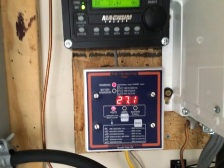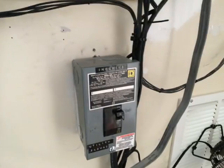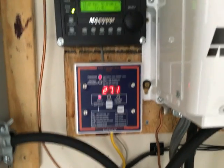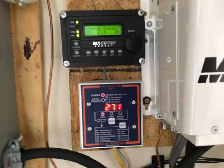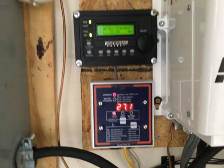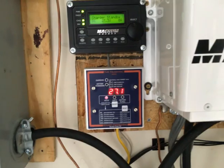They've been kept in constant float mode for 5 years, and later on, I'm going to go off grid, right, by flipping that switch. And I'm going to drain them down by maybe 10, 15% or something like that. Since these are AGMs, obviously I can't run these all night. But anyway, coming from someone who has, you can see the dust on my batteries.